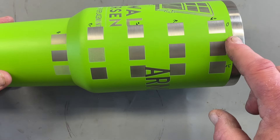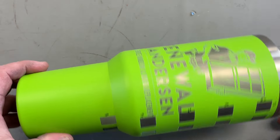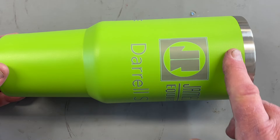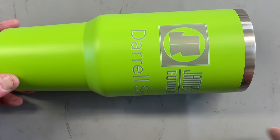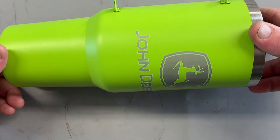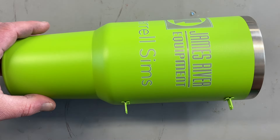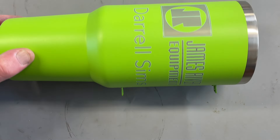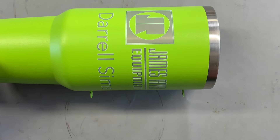Now, when you start messing with the beam combiner and forget that you altered it, this is what happens — it may look pretty but it turned gray because it didn't remove all the powder coating due to the wider beam. I forgot whether this was plus or minus, but it doesn't matter. Doing these tests cost me multiple cups because I forgot to reset it back to zero. That's one more reason not to alter the beam combiner — it's well more advanced than most people need.